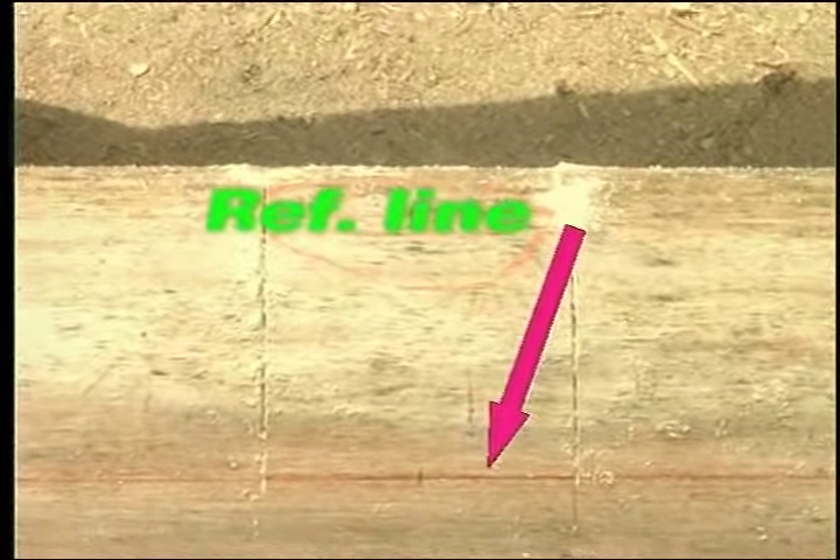Reposition the post and check the work. The post may be left uncut and a circular segment cut from the ridge instead — this would be a second choice. With the fitted post in place, mark the width of the flats on the ridge log so that a plumb cut can be made for the gable end framing material.